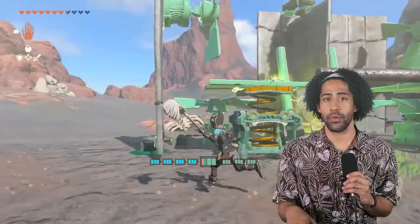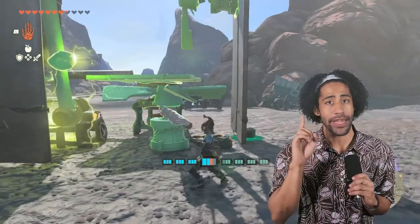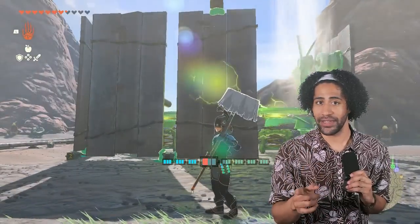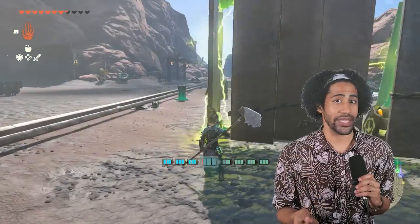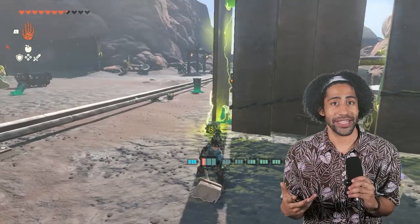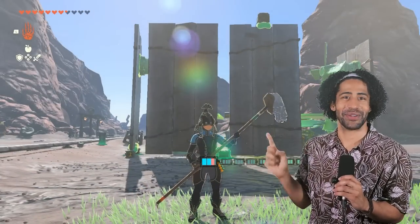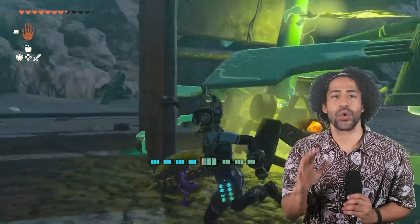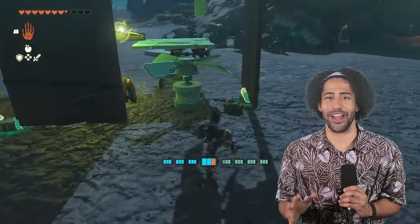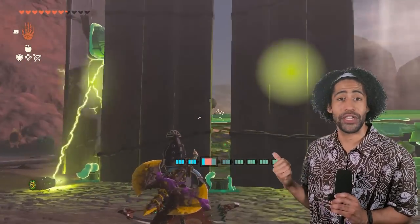Turning it on now to see if it works. Once the power's on, we can run to the front and see 0-0 on the display. When I turn A to 1, we get 0-1. When I turn B to 1, we get 1-0, or 2. Now all we have to do is turn both to 0, and we get 0-0 again. It worked way better than I thought while building it — I thought it was going to be flickering like crazy, but honestly it's not that bad. That's a half adder using only transistors as switches.